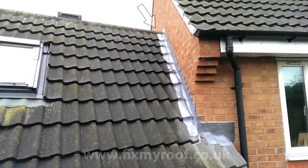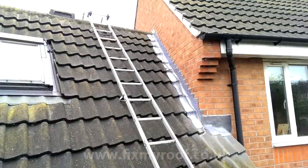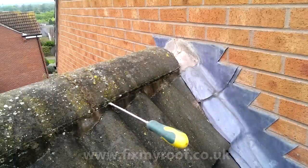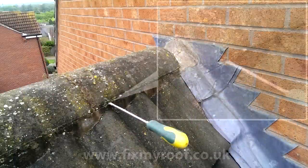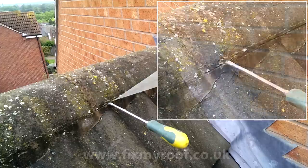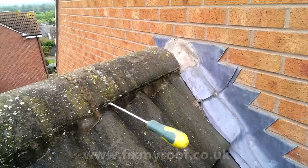The first thing to do is strip off any fouling ridge tiles at the top of the roof, so it's up with a roof crawler or cat ladder to get started. Over the years one of the easiest methods of ridge tile removal I have found is to gently hammer a slot head screwdriver between the ridge tile and the mortar bed - eventually a separation forms allowing easy removal without smashing anything or any need for a diamond cutter.